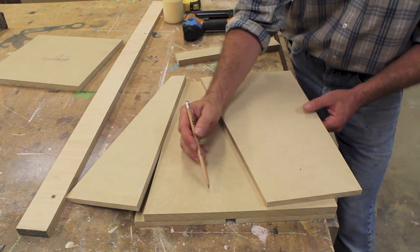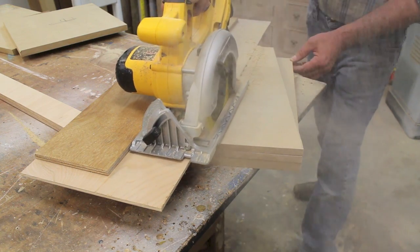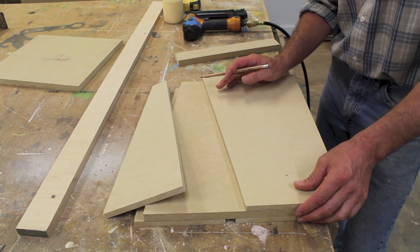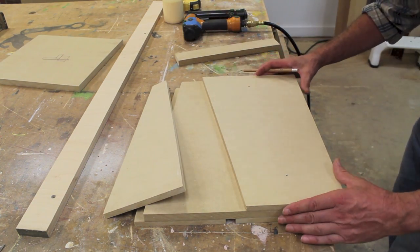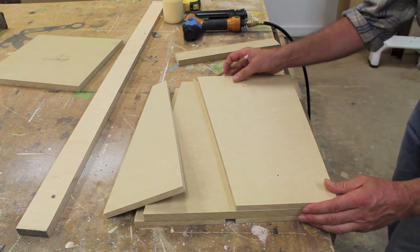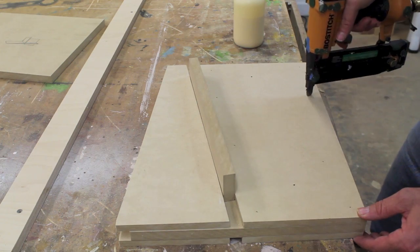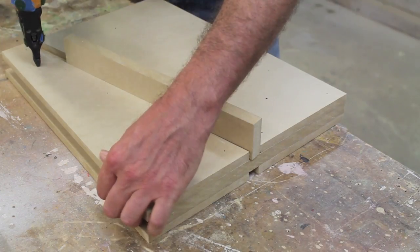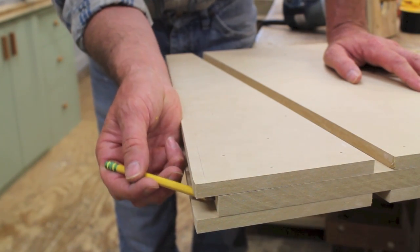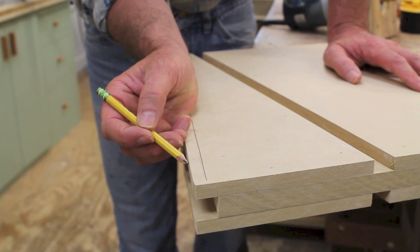To build the base of the chair I've sandwiched a piece of three-quarter inch MDF in between two pieces of half-inch MDF. What I did was screw two pieces of half-inch MDF together, cut this angle — which happens to be just about 8 degrees — using a straight-line rip jig and the circular saw. Now I'm going to attach the half-inch MDF to the three-quarter inch core, keeping it flush at the bottom, front, and top. Then I'll use a three-quarter inch spacer and attach the back. I want the half-inch MDF in the back to be flush with the three-quarter inch core, so I'll cut most of this off using the bandsaw and then clean the rest up using a flush-cut bit in the router.